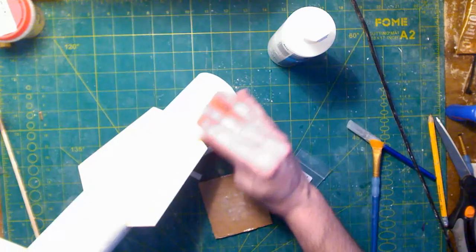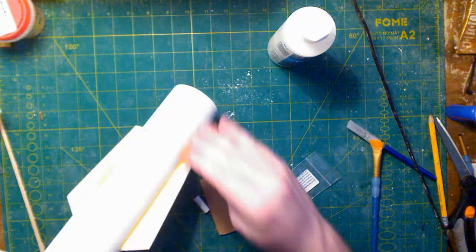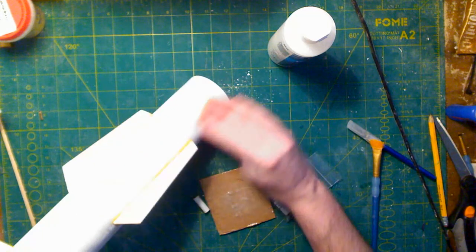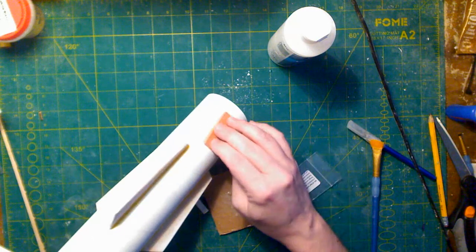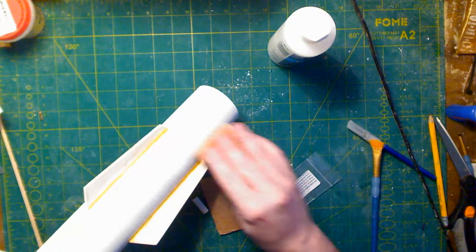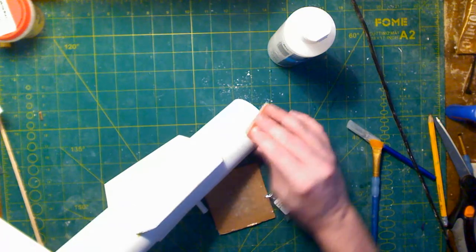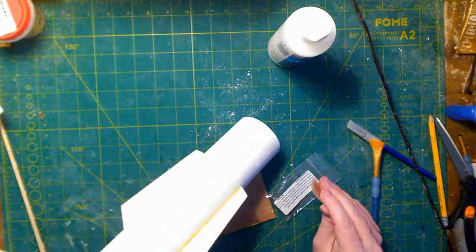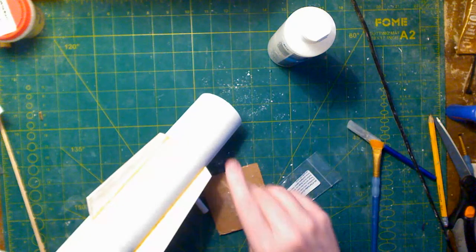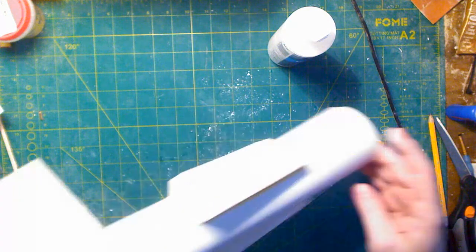Like I said, I did sand this in general, but that doesn't guarantee anything. Plus, when I did it, the light was different anyway. And there are some spots that I can see in the current lighting where I'm seeing these brush strokes that I didn't see before. I typically would get a rag or a sock or some kind of cloth and get rid of this dust afterwards. All right, I don't see anything obvious anymore, so we'll get rid of that.